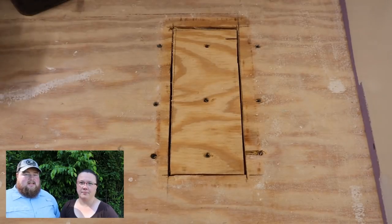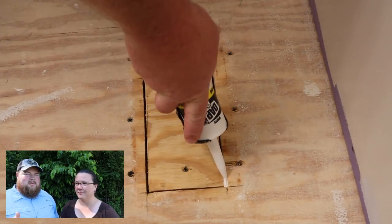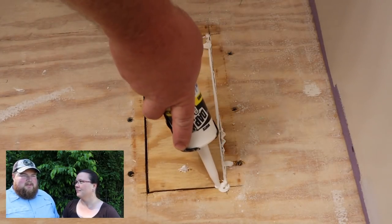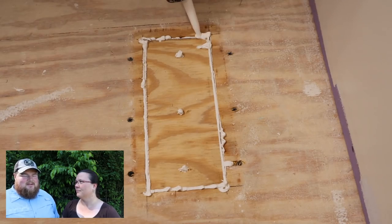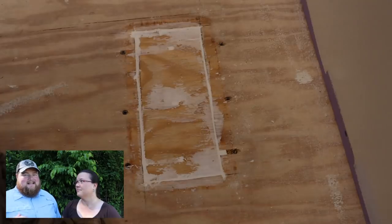Like Angela said, this flooring is 100% waterproof, but that doesn't mean it forms a 100% waterproof barrier. So if you're trying to turn your bathroom floor into a tub, it's going to get the subfloor wet. The benefit of this flooring is that when it gets wet, it won't pucker and expand and come apart or mold or mildew as easily as other flooring. So a little bit of a clarification, it's not as waterproof as, say, a sheet vinyl, but it is tons more durable. It feels and looks nice, and is what we chose to do.